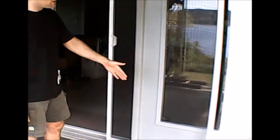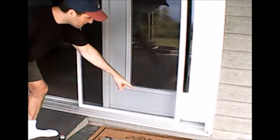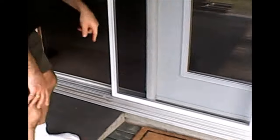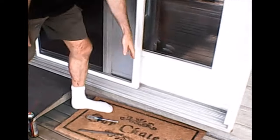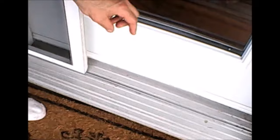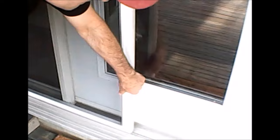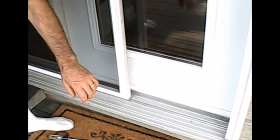So there are a couple of things to note on the door. The door fits in a track at the bottom and at the top of the door frame — two tracks — and there are wheels on each of the four corners. What can happen is if the track gets very dirty with sand, debris, leaves, and pine needles, and there's too much debris there, the wheel rolls over it, comes up on the track, and jumps off.